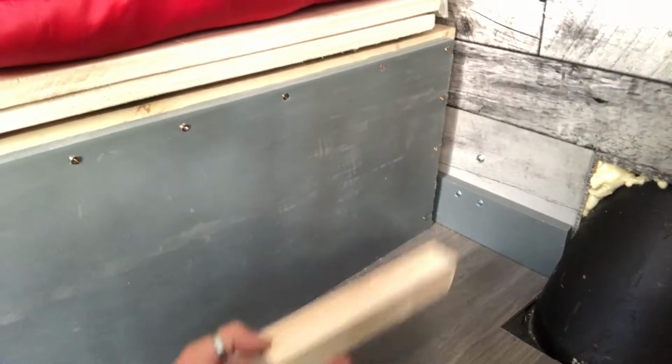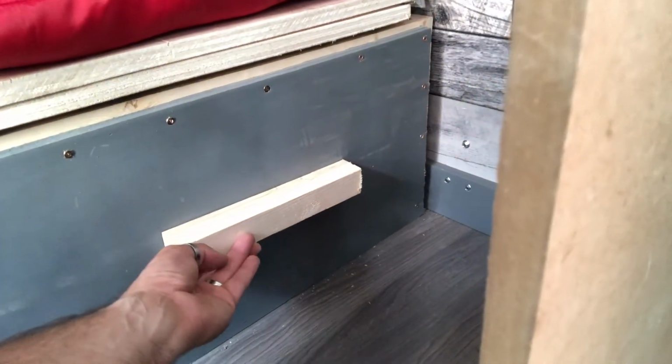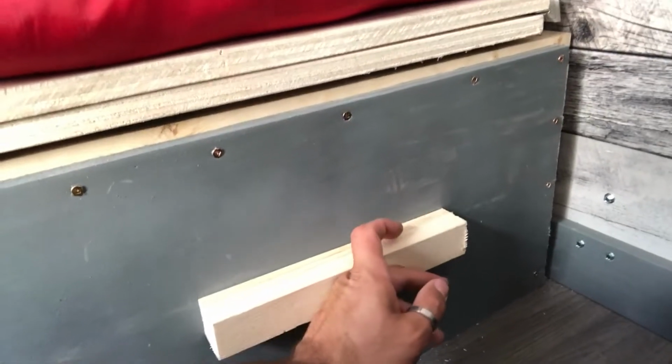And then I'm going to bring it up against the bottom of the shelf, slide it over, and hold it there while it sets, and then hit it with a couple screws. So I'm going to screw it here and on the far side here into this wall. And that way on the top, I can just come down with 2 screws in the middle. Should be good enough. And like I said, it's not scientific. That bloody fly. Get out.